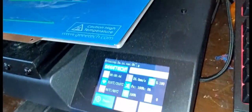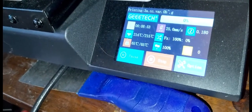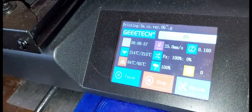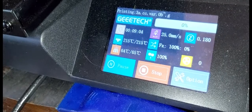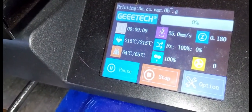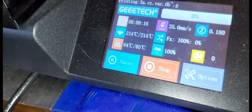My allergies are killing me today — it's Vegas. I was at a golf event on Friday for work. My allergies are killing me and I got heat exhaustion too; it was close to 100 degrees — about 97 degrees and 60% humidity, which is rare for Vegas but it's been raining. Anyway, this is printing at a bed temperature of 65 degrees and a hotend extruder temperature of 215.